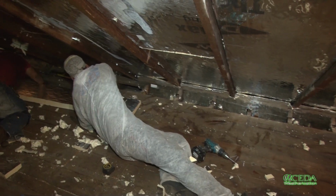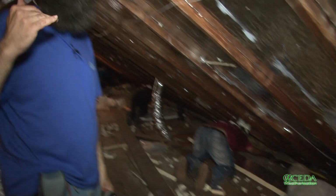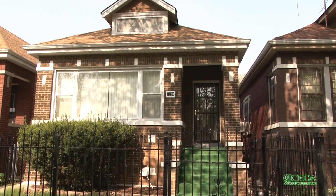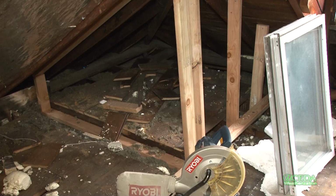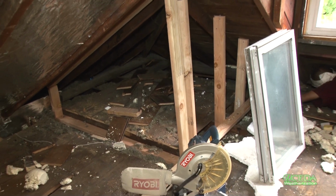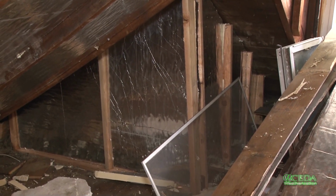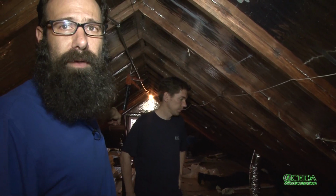Anyone who's familiar with the Chicago bungalow, and you probably saw it at the beginning on the entry, knows that this roof overhangs the front stairs, and that portion of the roof is sitting out over the exterior of the house, or unconditioned space. So what they're going to do, and I think Eddie's working on it right now, is they're going to frame a very light enclosure above that and bring the Thermax straight up, and they're going to push the space above the porch completely outside of the thermal boundary. And then they'll air seal that when they're done. They'll do that in the front. They're going to do it again in the back above where the back door is.